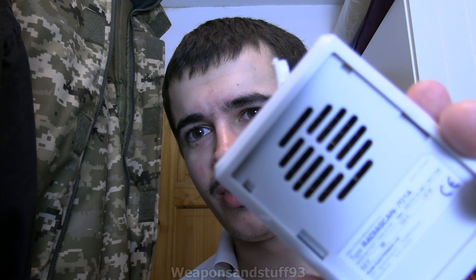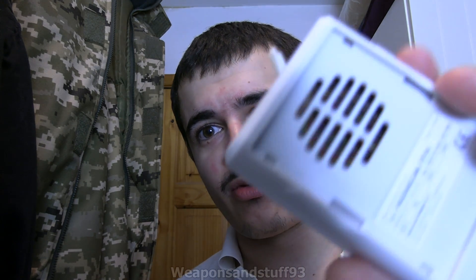The only complaint I have — and it's not really a complaint because I don't know how RadiaScan could have done it differently — is that to measure alpha sources you need to have the alpha window open, which means there's a very high risk of contaminants getting inside the Geiger counter and permanently skewing your readings. My Terra-P permanently reads 0.6 microsieverts now because I got some contaminated rainwater in it. I think this should be possible to clean, but with most Geigers the point is don't get them dirty in the first place.